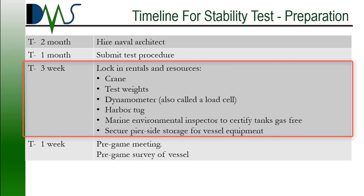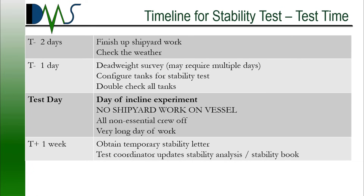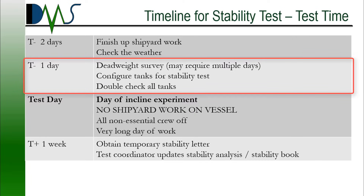At three weeks out, we're also looking at securing contracts for renting all the test equipment. One week out, things are starting to get exciting. Ideally, you'll meet with the coordinator on the vessel, have them do a pregame survey of the vessel, and provide any guidance on vessel readiness. This is also the time to offload any dead weight that needs to be removed for the stability test. Two days before the incline experiment, the test coordinator is on site with their staff doing the dead weight survey. T-minus one day before the incline experiment — depending on the size of your vessel, that dead weight survey may require more than one day.